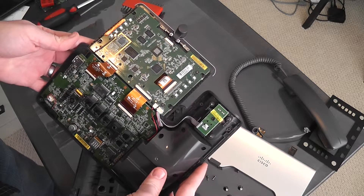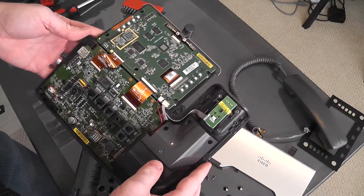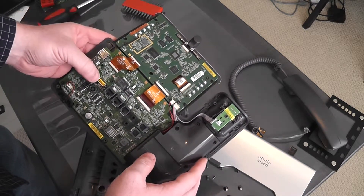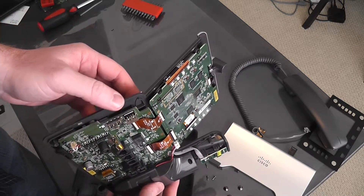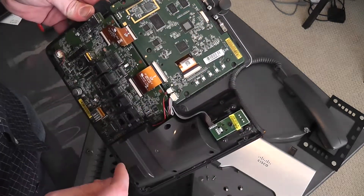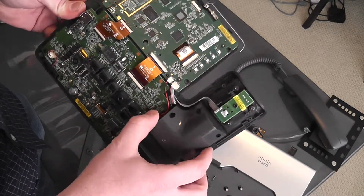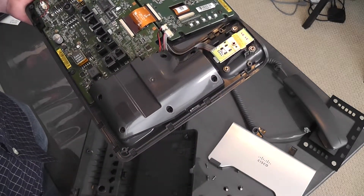As you can see, there is the back of the system. The controls, the circuits — pretty relatively complex. We have the ports, Ethernet ports, as well as the RJ ports for audio and so forth. Here's a USB port from the back of the unit. There's also a USB port on the side — this is where our module attaches for key expansion. There are screws holding each of these circuit boards in place. This looks to be the speaker module — let's pull that off and see what's behind it.